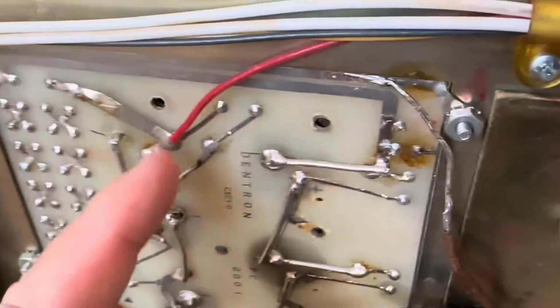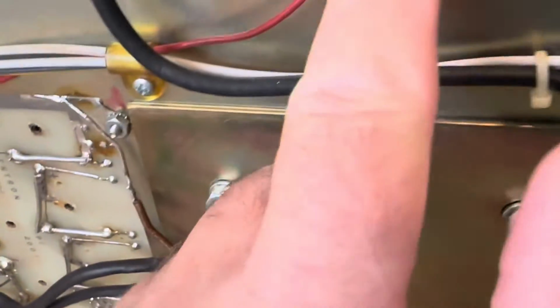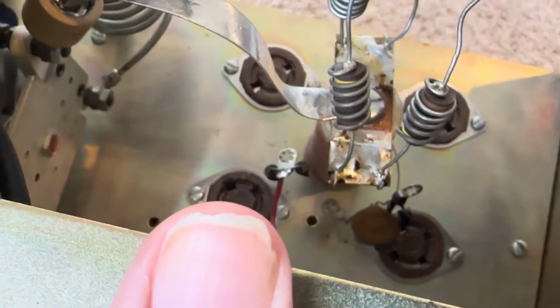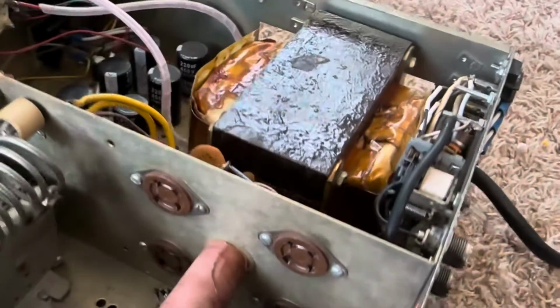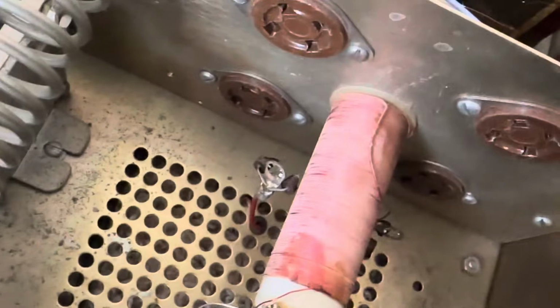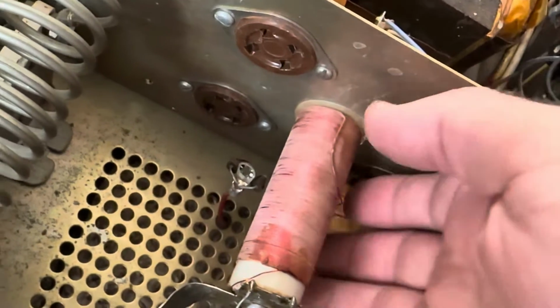That's all I see. Anyway, I'll try and fix up the high voltage and get this thing going. So the high voltage comes in from here. Thin little wire too. Just goes up through here, tiny little grommet for feeding the plates and the tubes. And you can see where there were two resistors on there. Those were sandwiched in between an insulator, and then the other end of the resistors are going to feed to this thing here, which feeds the bottom of this tower.